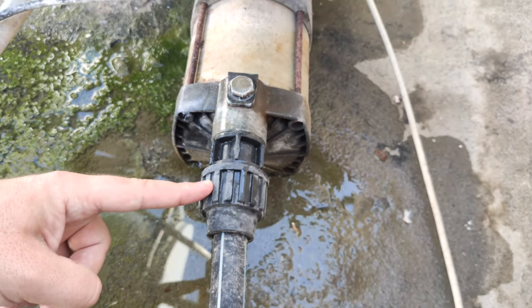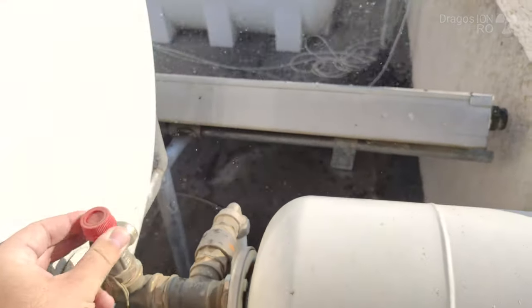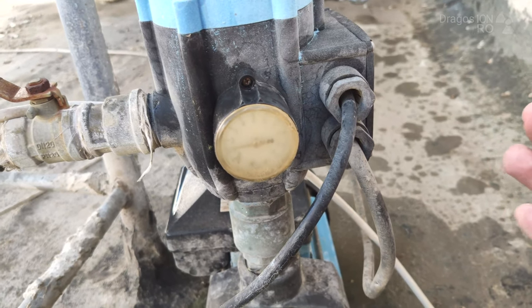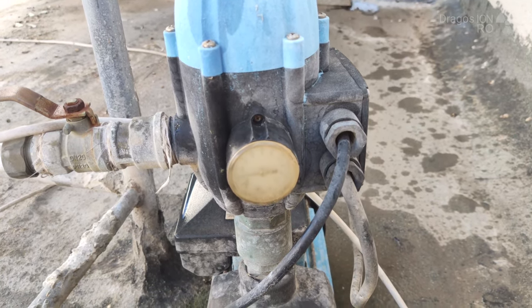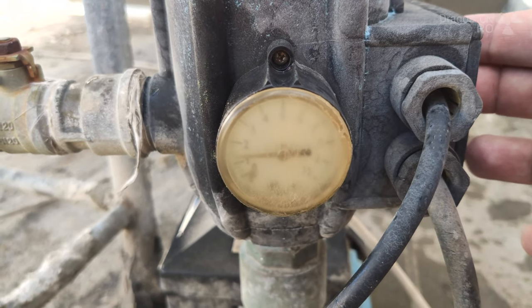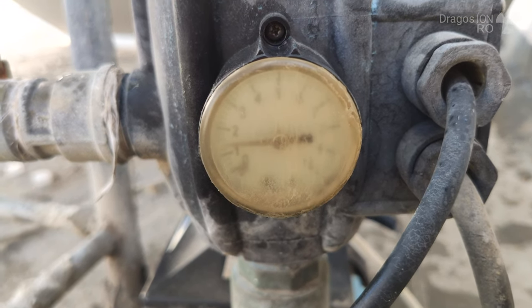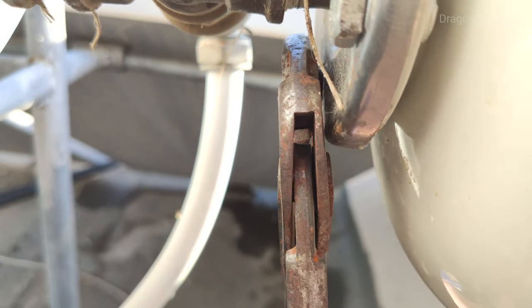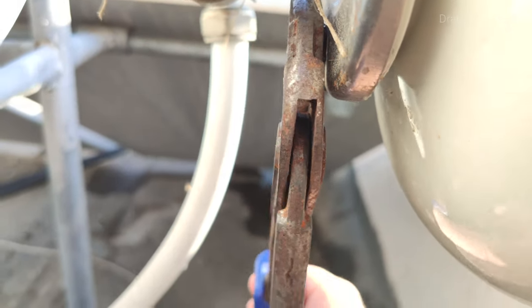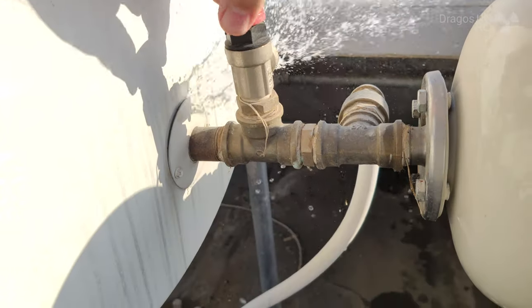That's one connection going to the pump, another connection the inlet, and the electric connector and that's all really. This is just a valve to check the pressure, to relieve the pressure. The pump is working but it's leaking. The pump is really old and I'm pretty sure after the pump stops the pressure goes really down really fast. The expansion tank also leaks a bit so it has a few bolts here, I could try to tighten them, reduce the leak a little bit, but if the expansion tank leaks more I would have to change that also.